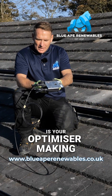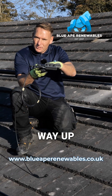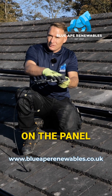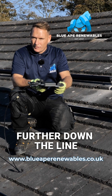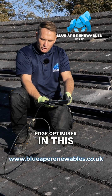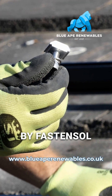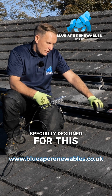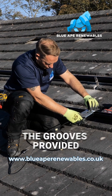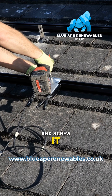The correct way of fitting them is making sure your optimizer is flat face up, because if it was the other way it'd have an impact on the panel which could cause issues further down the line. So you always fit a SolarEdge optimizer this way. You've got your block nut supplied, specially designed for this rail — once it's in situ, you slot it into the grooves provided and screw it in.